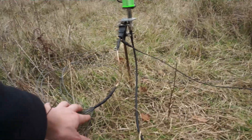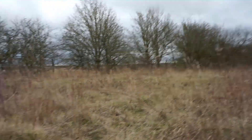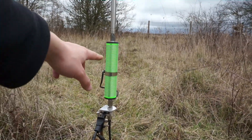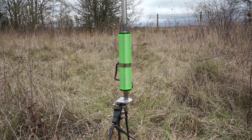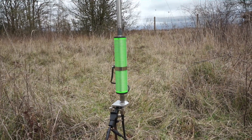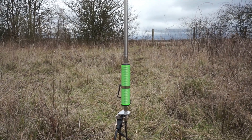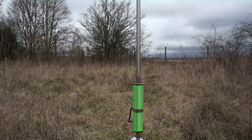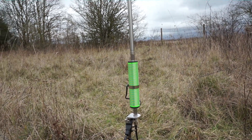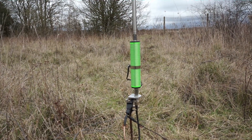I've gone for a bit of a configuration change because I wanted to try and get this working on 40 metres. Still got the radials laid out, and I've added an extra counterpoise wire that goes off over there, just to give me a slightly better ground. I've put the slidewinder coil in. I should point out that Dave from M1EC antennas recommends not using long telescopic whips like this one with the slidewinder — it can overstress it. I've only got around three metres of whip on there; I've shortened it specifically so I don't stress the loading coil, and we've only got light winds today. Tuned up, we're getting about 1.3 to 1.5 to 1 on the SWR, so I think we should do okay.